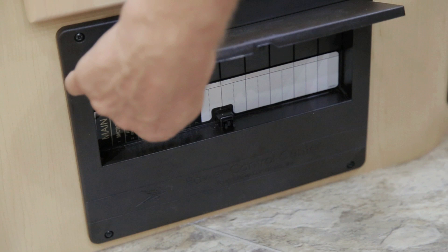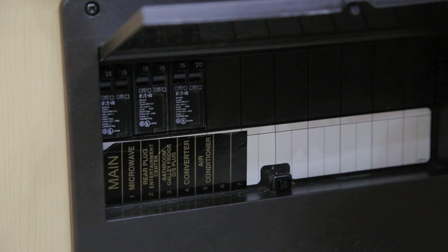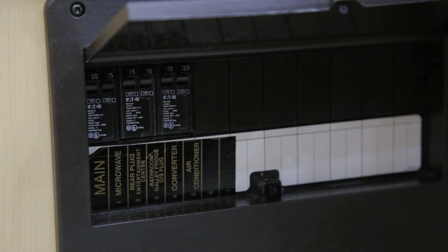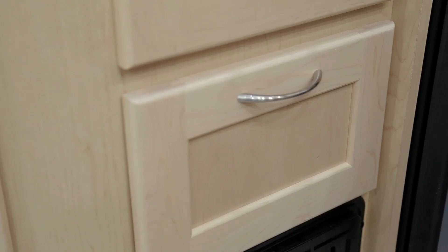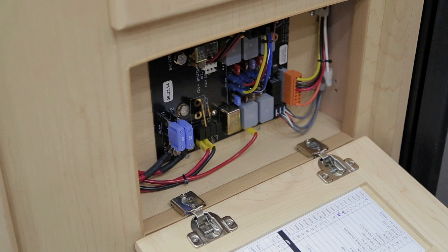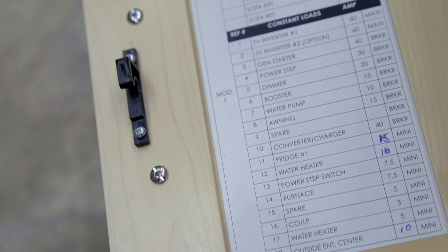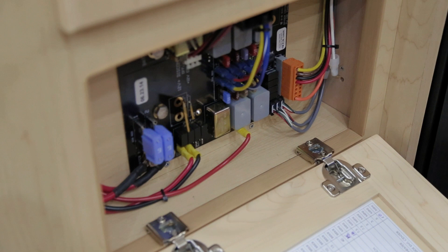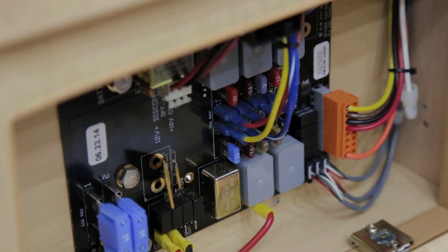If one of your appliances is not working, check the breaker area. In most cases, if breakers are tripped, they will go into a neutral position — not locked in the full upright position. In some situations they will be close to the full upright position. To reset, ensure the breaker is switched fully off and then bring it up and clip it into place for a full reset. All breakers in the multiplex wiring load center hub are auto-reset breakers — no manual resets needed. Once the breaker cools down, it will automatically reset itself.